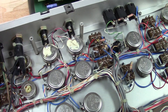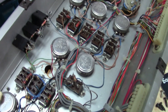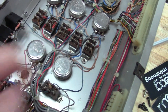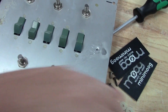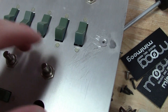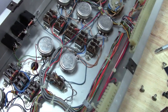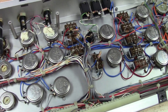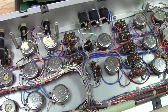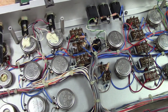On the early units you have a screw head in the front, so the only way to pull one of these switches is to remove the front interface panel and take the screws out from the front — which is quite a nuisance, especially if you're gigging. That's why they moved to the nut and lock washer design. On the later chassis the post is actually machined into the chassis — not a separate screw — so you just take the nut and lock washer off and replace the switch. Just a bit of Mini Moog history trivia.